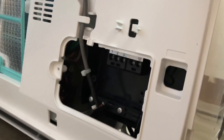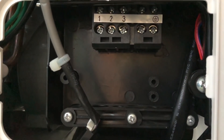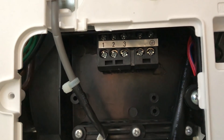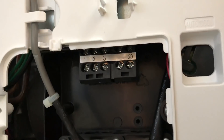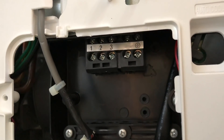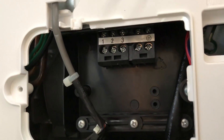I've got my wire here which is going to connect the indoor unit to the outdoor unit. We open the front and there's a little panel inside that we popped off — that's where your wire connectors are. You can see there's a one, a two, a three, and a ground. It does not matter which ones you connect to what; all that matters is that the same color wire you use to connect number one on the inside is used to connect number one on the outside. Use green for your ground. If you think you can't remember, just snap a photo of what you use on the indoor unit to make sure you do the same thing on the outdoor unit.